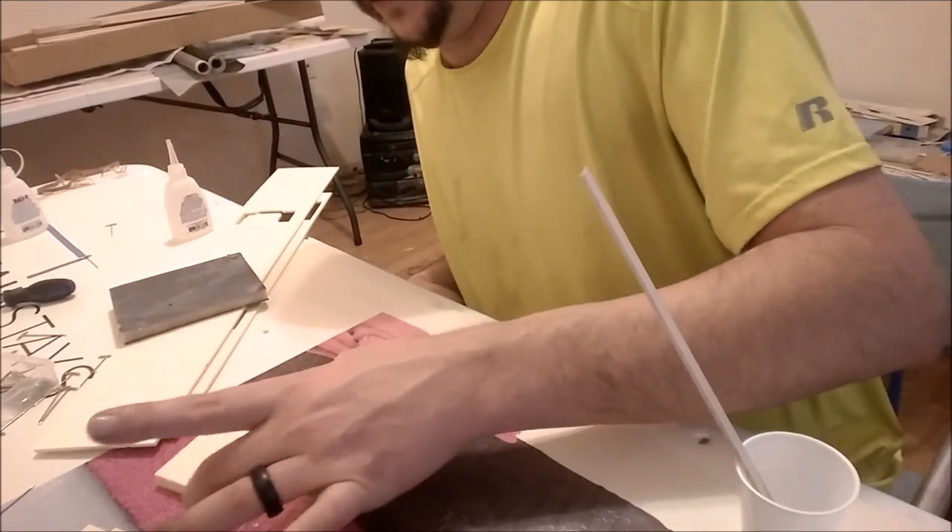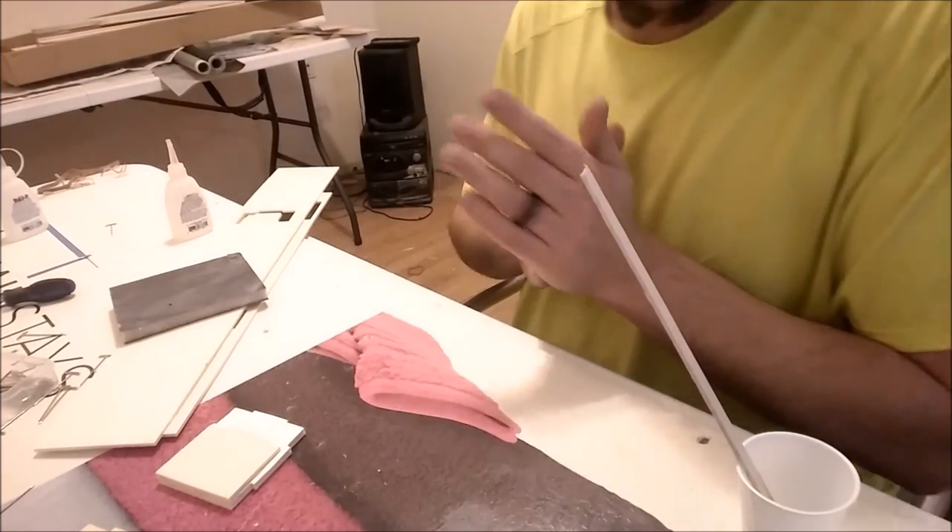All within the set time. I think that's all I'm going to do today — we have epoxy parts and the rest is going to be CA together, but these have to be cured before we can go any further. It's Sunday, I've got family dinner here in just a little bit, and we'll pick back up tomorrow evening. Let these things set for 24 hours so they're cured. 30-minute set time, 24-hour cure time — remember that. That way you don't jump in and start playing with stuff way too early and get in trouble.